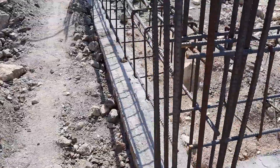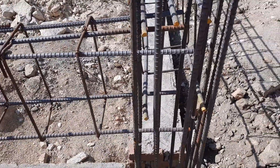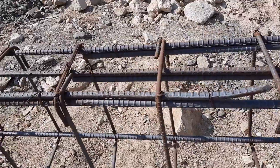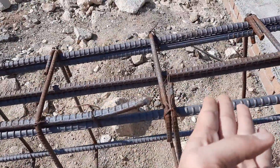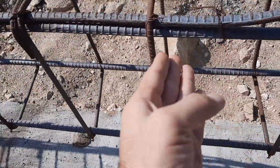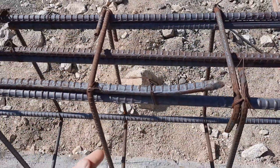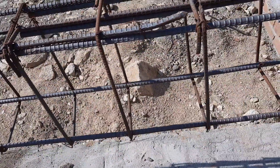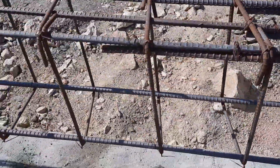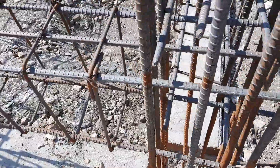Here they should provide the crank bar or extra steel rods at the junction between beam and column. You can see this is the corner beam — you can't see any development length to make a good bond. The spacing is maximum here. They also provided lapping length at this place, which is not good. This is not proper design because at a distance of L/4 you are not allowed to provide lapping length in the tension zone. If you need to provide lapping length in the upper portion, it should be provided at the middle.